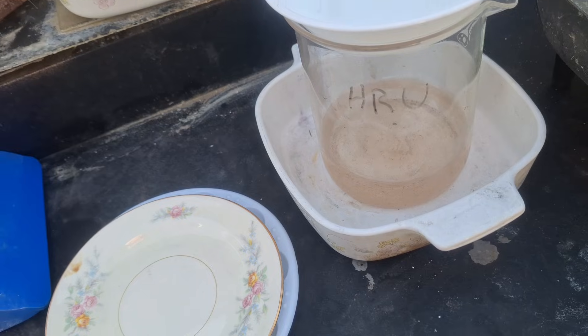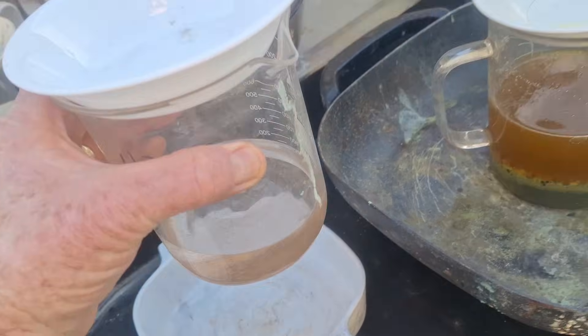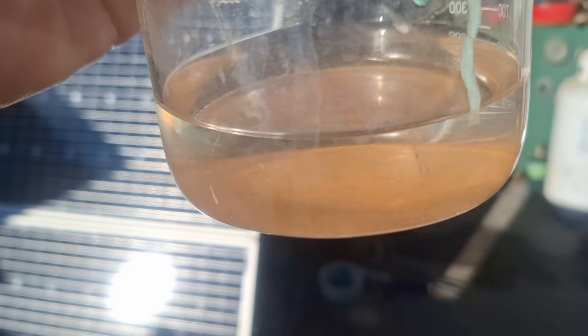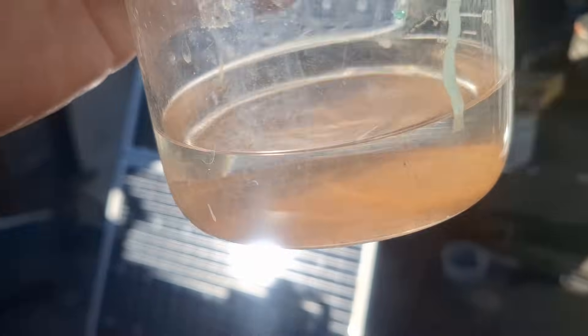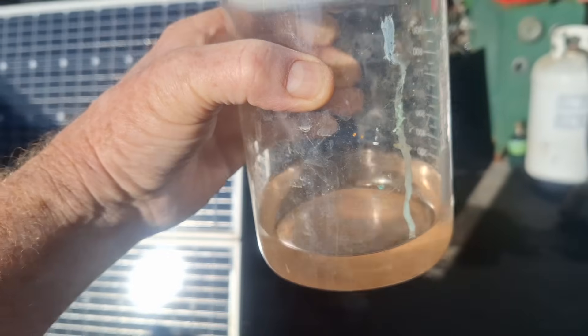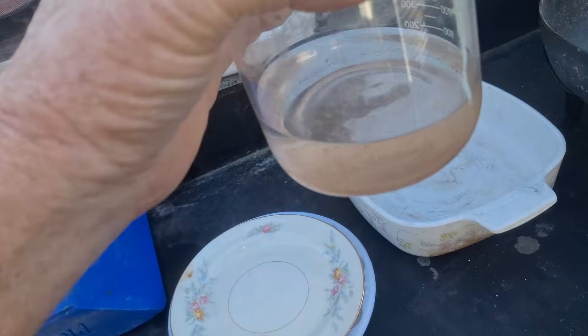I had mostly that Mount Baker Mining and Metals grit in there, basically getting the gold out of the sulfides. I ran it through hydrochloric acid, then through sodium hydroxide, bleach, and distilled water to free up the gold from the sulfides, and then again through a little hydrochloric and aqua regia. And now it's sitting in water.